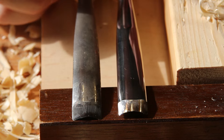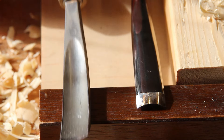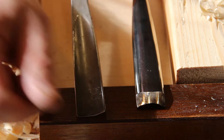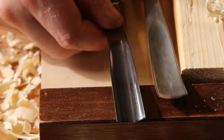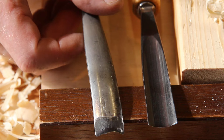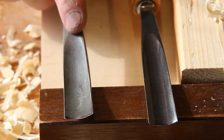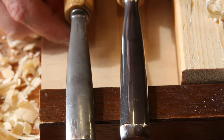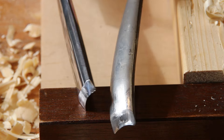There's something I've noticed when sharpening these: the blades have this coating on them. It looks like it's overspray from the handle maybe. Just see how dull and cruddy it is. It comes off with a bit of rubbing and white spirit or turps, and when you do it you end up with something that's a bit more polished. So as well as needing to sharpen them, you're going to have to get this coating off. I think it's a coating either deliberately put on to protect the chisel until it gets sold, or it's overspill from the process of spraying the handles. That's just something to bear in mind — if you buy these chisels you're going to have to deal with cleaning all the crud off of them first.